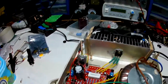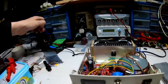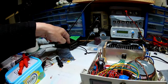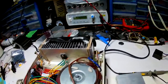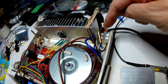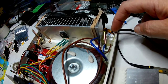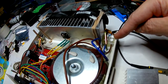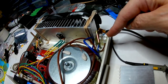I'll give you a quick demonstration of just putting it on. There's a switch and then there's a fuse built into here - it's too high rated for this, but I've already got a connector block there. I've put some silicone sealant in the top so the mains is isolated through there, which is a little safety measure. I've also put a whole load of hot glue around that to just keep it in place.